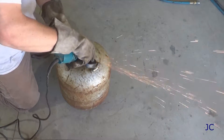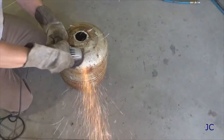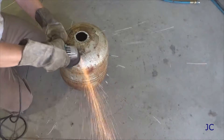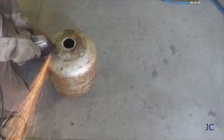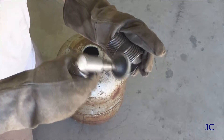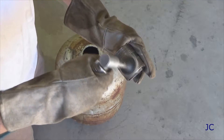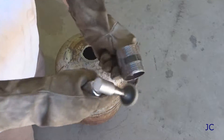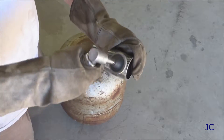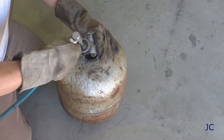This tank didn't have any noticeable problems, so it was time to get out the grinder. I used the grinder to take off the leftover material from where I took the valve guard off, and to clean up around where I cut the hole in the top of the tank. I wanted to get all the paint off so that would be good for welding. The tank's pretty well cleaned up. Now it's time to clean up the pipe nipple that we're gonna weld into the top of the tank. Just like the tank, we want this thing to be pretty clean so we get a good weld on it. I went with a 2-inch pipe on this project because I wanted to make sure we had a big enough pipe to get the air out of the tank quickly.